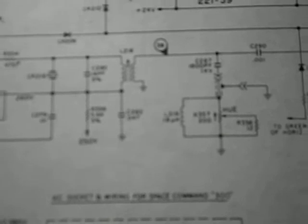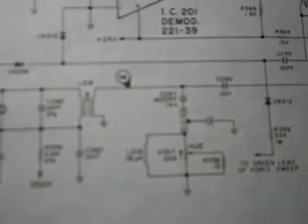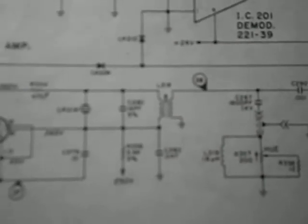If that's not it, there are of course other possibilities that could be in play here. I'll see if I can find a schematic to point at. These are all similar in the way they work. Okay. What you're looking at right here, here's your hue adjustment. There's the transformer, I believe, that's being adjusted. So you've got a pot, you've got a coil across the pot, you've got a resistor here, I think it's a 12 ohm resistor, and you've got a 1800 PF 1K, that's probably some kind of disc cap, and you have a .001 involved here. I really don't think this is the problem. If the hue adjustment is working, I have to assume these parts are probably okay. I'm almost 100% sure it's going to be the adjustment of this transformer we're talking about.